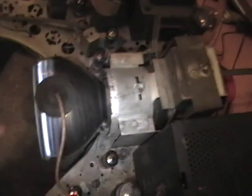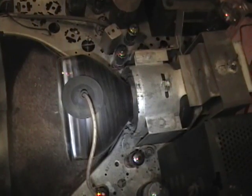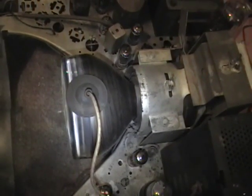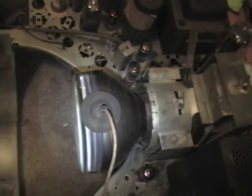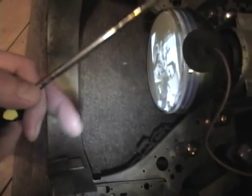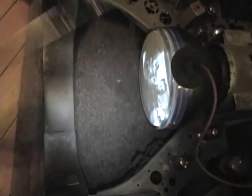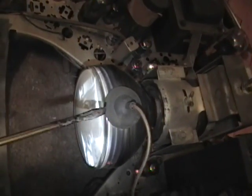To get this one out, I had to first loosen the steel band that secures the tube in place and work on the back end. What we've got front to back: a high voltage lead — don't touch that, don't go anywhere near it when the set's on, or when it's off until you've discharged the picture tube. That can hold a charge, and if you're lucky it won't kill you, but you're going to feel it. Easy way to discharge: take a screwdriver with an insulated handle, ground the metal to the chassis with an alligator clip and wire, turn the set off, and slide the blade underneath that rubber cap until you contact metal.